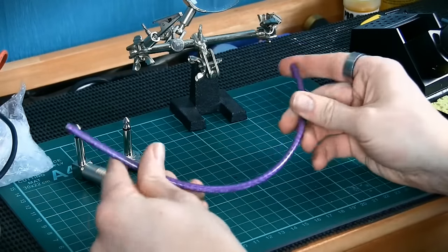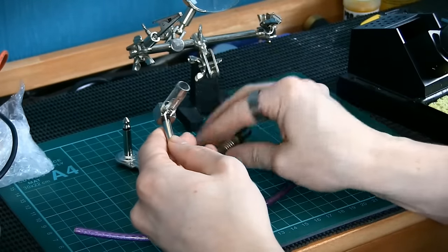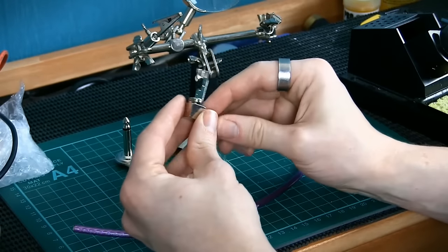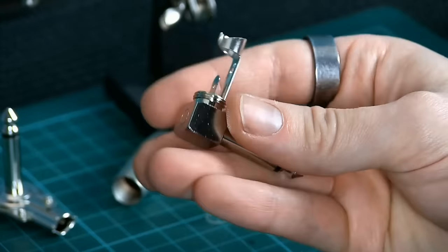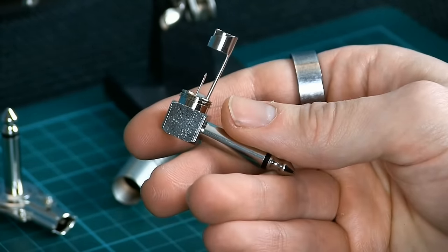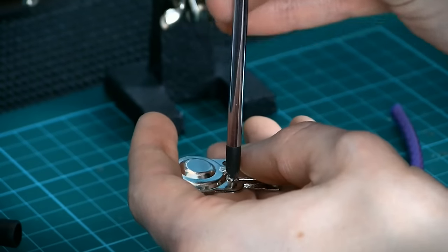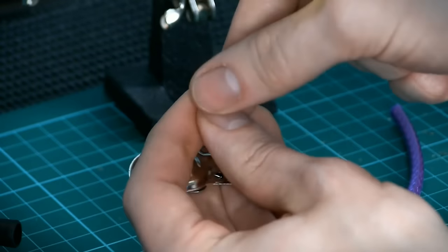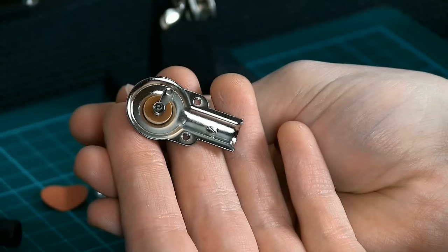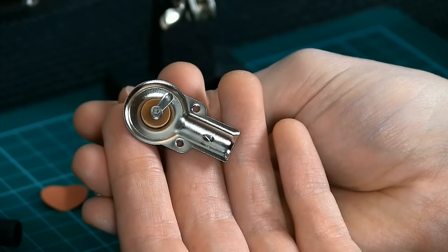This particular project needs all different lengths of cables so I'm cutting the appropriate lengths as I go. The square jack has a screw-off barrel in a clear insulation section which we can set aside for the moment. Inside we have two solder lugs — the small one connects to the tip of the jack, that's our signal, and the long one is for the sleeve, our ground. The pancake jack has a different construction — it has two halves held together by tiny screws. Inside there is an insulation disc to prevent the signal wire touching the grounded shell. We can see the small signal tip lug in the centre. These jacks don't have a solderable ground connection; the body shell clamps directly onto the shield wiring.